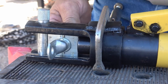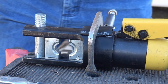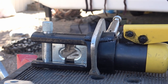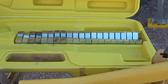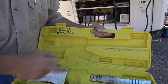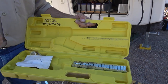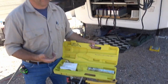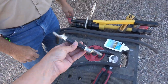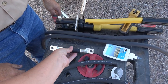You can change the dies in the hydraulic crimper to get different sizes - a nice guy named Mike gave this one to me. You can switch it - this is a metric set, and I've been working out conversions for the different kinds and sizes. For smaller number four wire I have another one I picked up at Harbor Freight that works great. One tip when putting on these connectors is to think about how you're going to orient it with the batteries - you can see he's got one going one way and the other going the other way because it's a jumper-type cable.